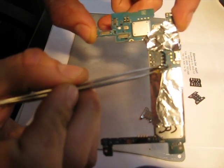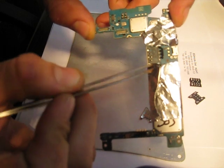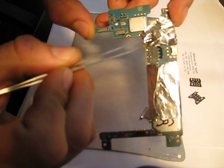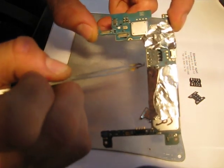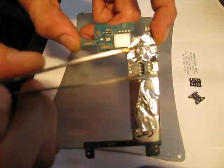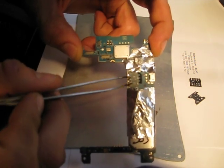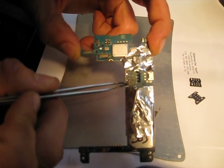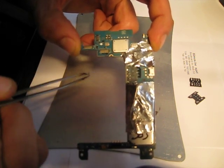The best way is probably to Dremel it — you just cut here and here, and then unhook those, desolder them, and basically after that, you put a little bit of heat here, maybe flux on the welding points, heat up, and then this will come right off.